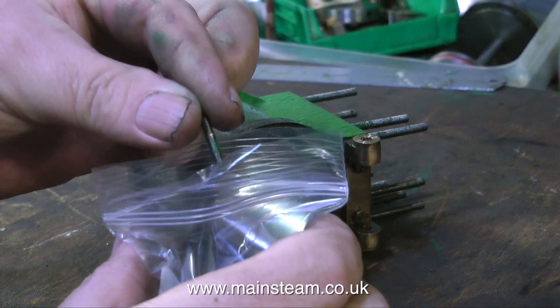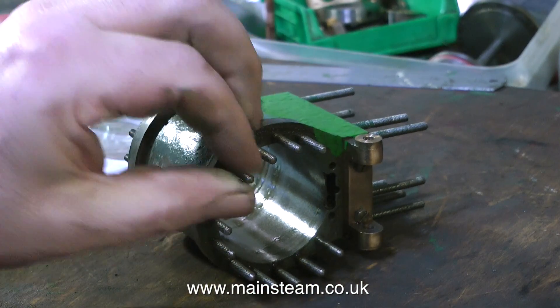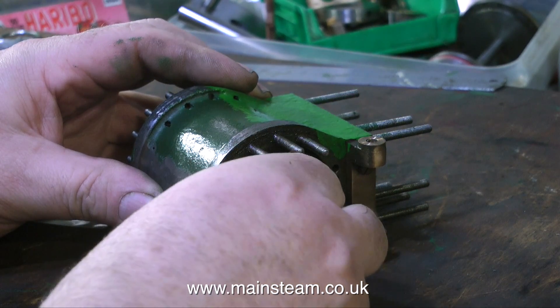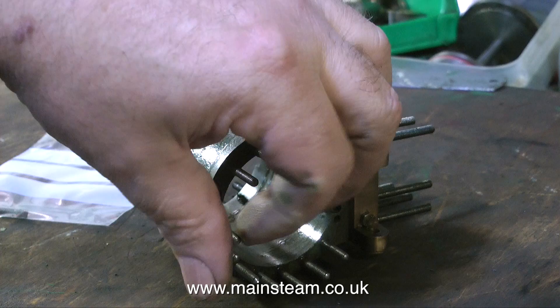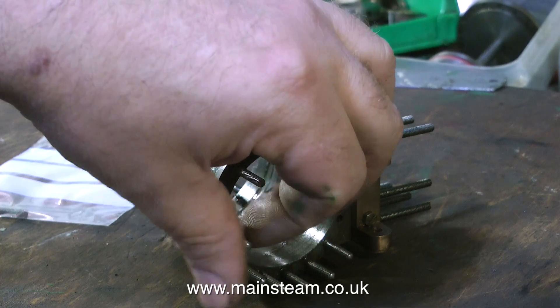The first thing I have to do is get the cylinder down to a bare cylinder, so I'm removing all the studs. I need to shorten these anyway because they were originally fitted with locknuts so they're a bit over long. Some of the studs came loose very easily — some complete with the locknuts and some are just finger tight. So the first thing to do is to obviously remove the loose ones, which I'm doing here.